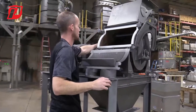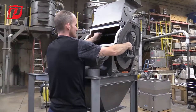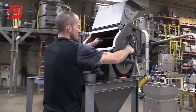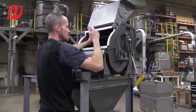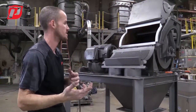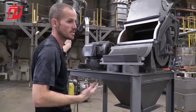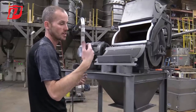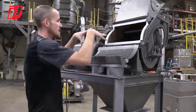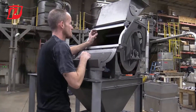Once we've got the lock and collar off on this side and the pin out, basically what we're doing to change the hammers — you can either have somebody helping you or do it by yourself depending on the size of the machine. Also, before we go ahead and put our hands in any type of machine, make sure that it's either completely unplugged or you put your lockout tag on it for safety. We never want to put our hands or any part of our body inside this machine unless it's been turned off and we know it's not going to turn on.